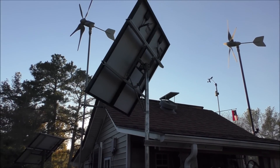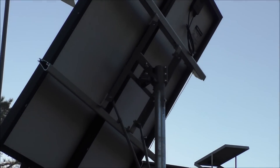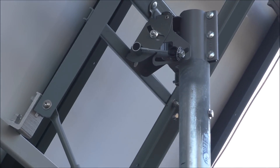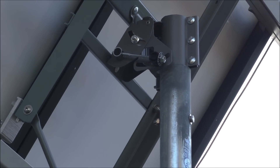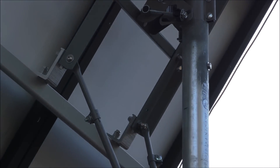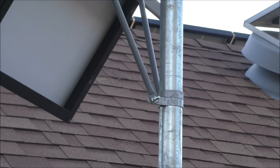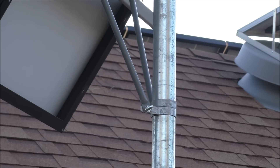Let's look at the back side. Here's the bracket itself — it's stout. There's a hole drilled in there for the schedule 40 pipe, two and three-eighths. And there are the wind and snow load struts from the back side — two-inch, two and three-eighths band braces, galvanized.